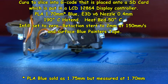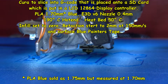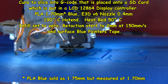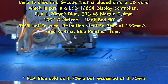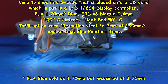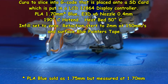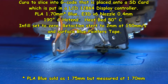The nozzle is at 190 degrees. I'm printing PLA and the heat bed is 50 degrees. All layers are set to 190 — I'm not asking it to lower the temperature as it goes on to the next layer, it's just set to 190 for everything on the nozzle. E3D version 6 nozzle, 0.4mm nozzle on there, printing PLA.